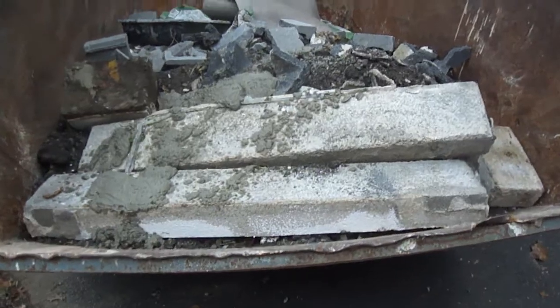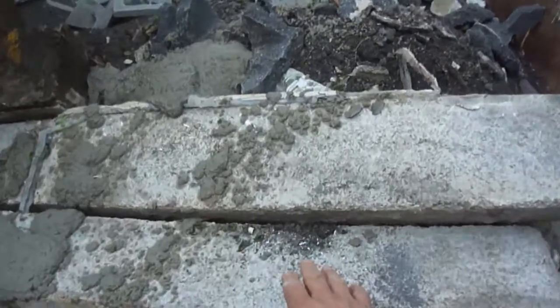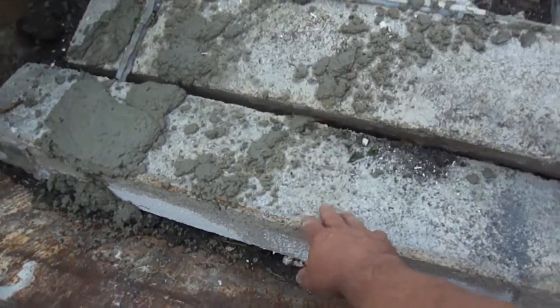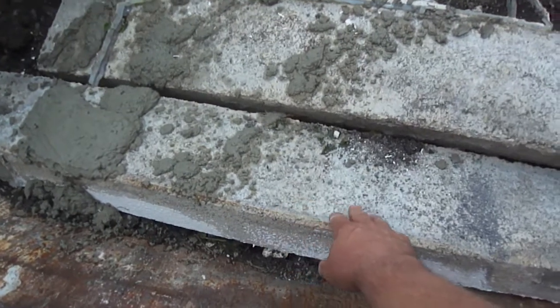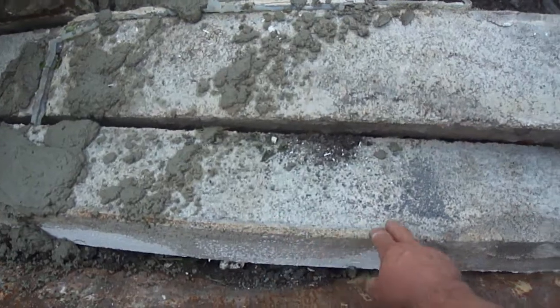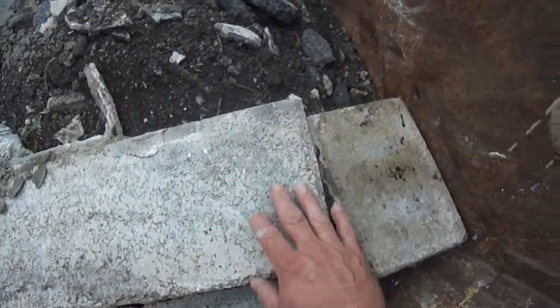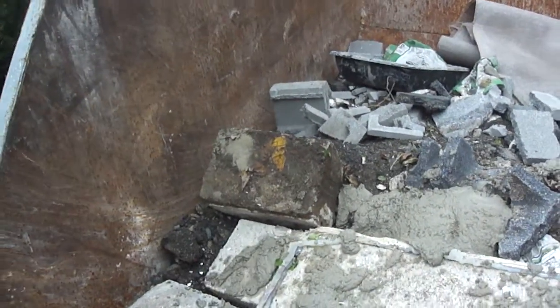These things I don't like — these are the lintels for the back porch. They hold up a cement slab; you're supposed to put the cinder blocks underneath of these. These balance the concrete pad on the top of the concrete block back porch. So you want to have these things in the corners when you build a porch.